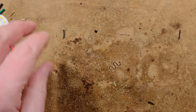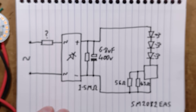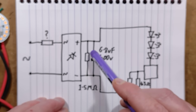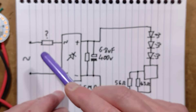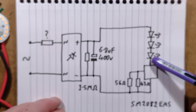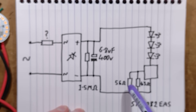Just for completeness, here is the schematic. We'll take a look at the components and the bit that failed. This is the fusible resistor — it's gone bang, which is what it's supposed to do. We've got the bridge rectifier which has also gone bang, but may have been caused by this capacitor here bridging out briefly, causing a pulse of high current that blew up the bridge rectifier and took out the resistor. After that it goes through a series string of multi-chip LEDs, then the SM2082 chip with a couple of current sensing resistors — by changing the value of these or cutting one out you can actually change the power of the light.